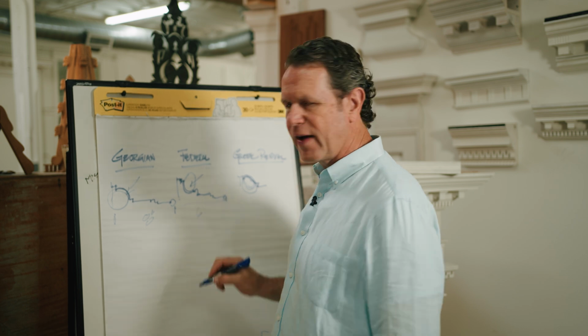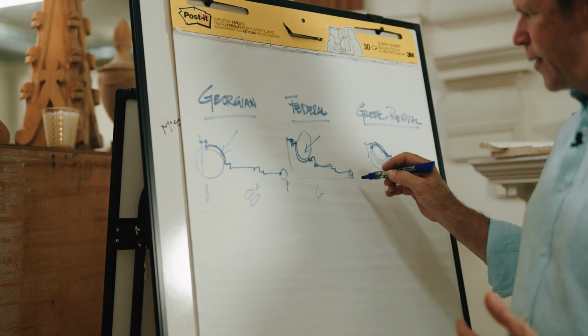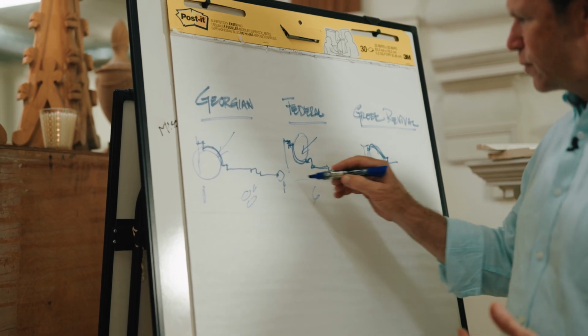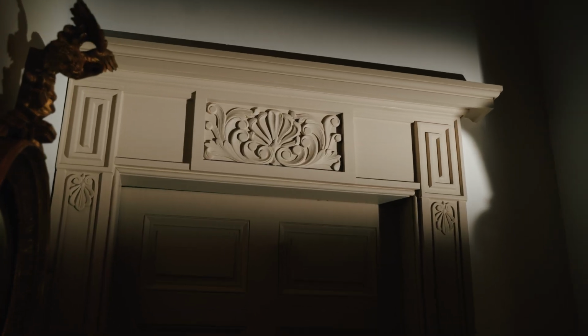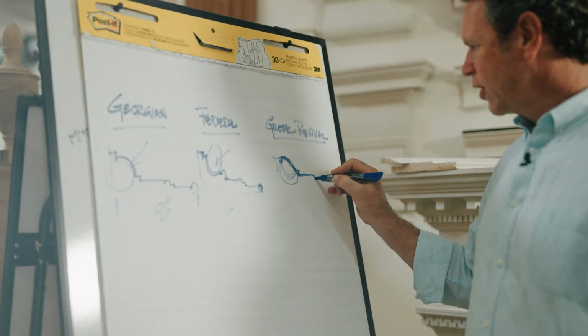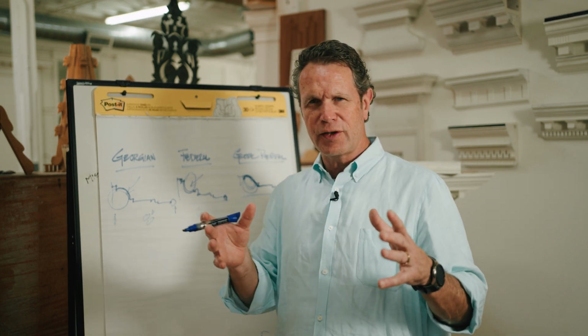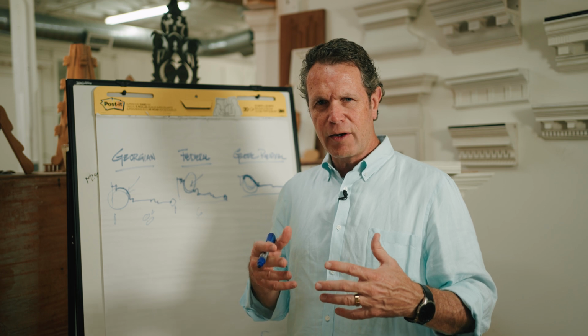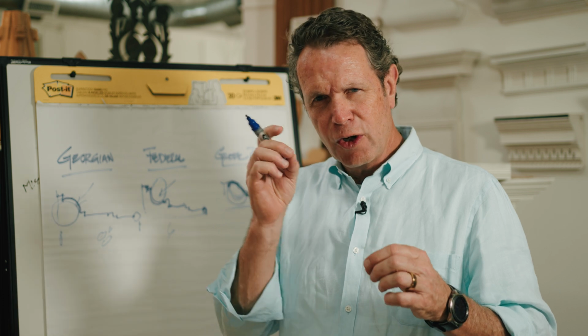So this is now only about 5 or 6 inches, and it's been cut away, right? We don't have the beads. If there is a bead on there, it's very small compared to this bead. So it changes. And then when you go into those Greek Revival rooms, especially Georgia room, it has hard shapes and then lines that look stone-like and look straight. Remember the pilaster in the Empire room where the columns and the pilasters just step down. There's not a bead, there's not an ogee, there's not a scotia. They're stepping down and they're strict, right? And very hard line and very crisp shadow lines.